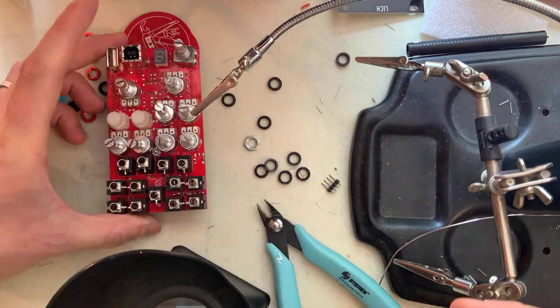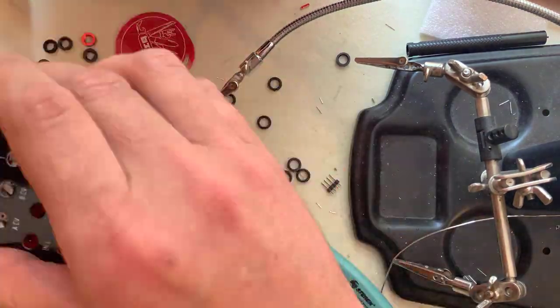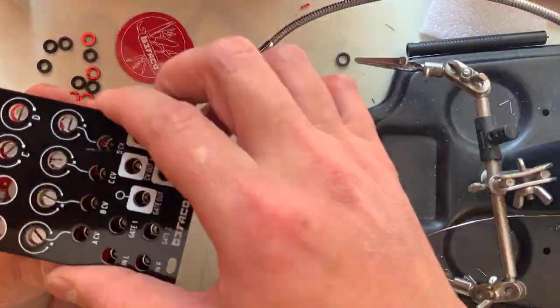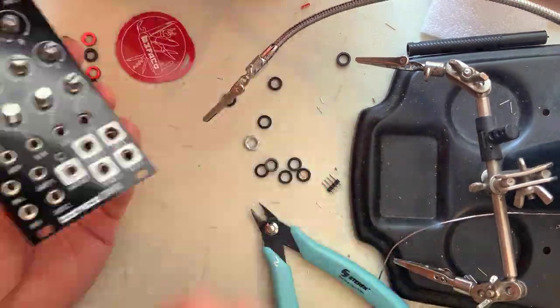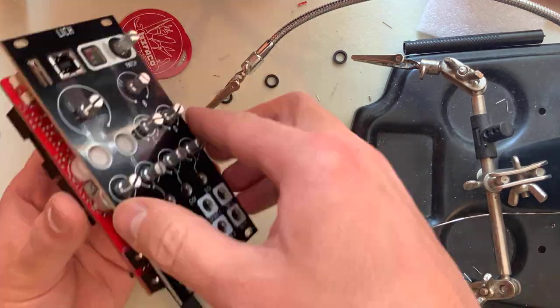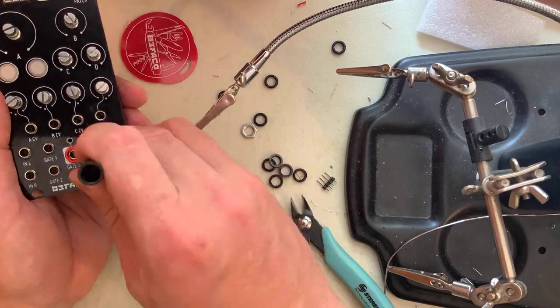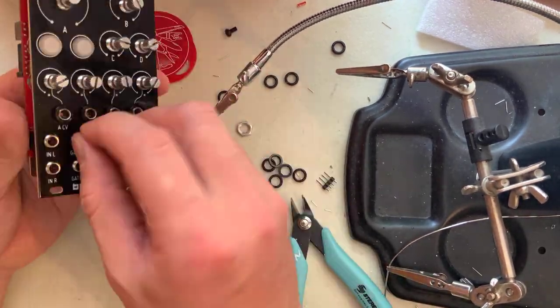Now place the plastic window into the OLED hole from the back side of the panel. Remove the protection plastic from both sides. Now you can use some hot glue or tape to stick it on, but I found that on this panel it fits fairly snugly, and once the display is soldered on, it does a good enough job of holding the window in place. Now attach the front panel, adjusting the parts one by one if necessary until they fit.